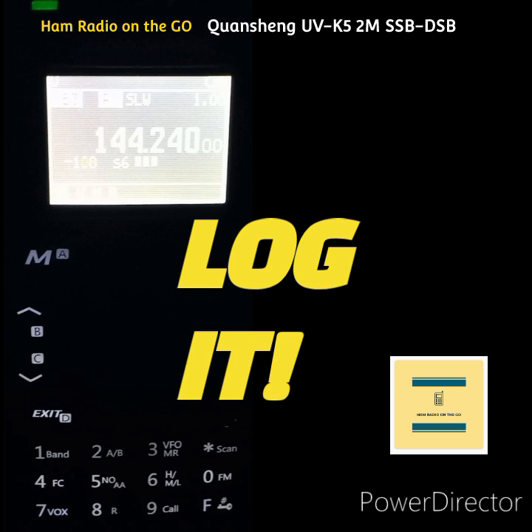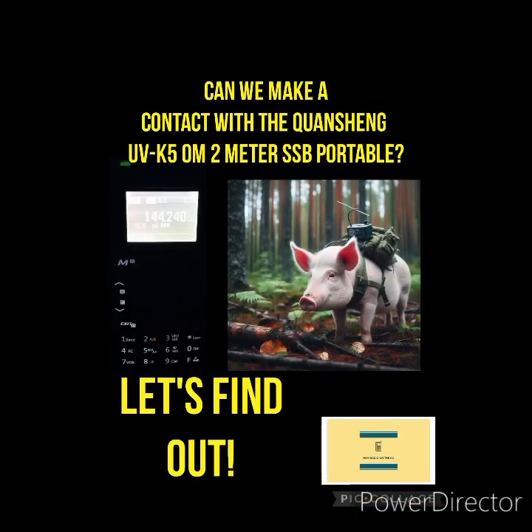There you go — a nice contact with Tony, WV2C, nighttime contact on 2 meter SSB. He was on upper sideband; I was using double sideband with the Quansheng UVK5. I've been looking to get a contact using that double sideband feature on the 3.0 IJV firmware upgrade to see how I can copy the stations and how they can copy me. Crystal clear audio reception of Tony's station, but he was hearing what appeared to be RF getting into the radio — that's the double sideband to upper sideband copy. Worth doing more experimentation with that mode, but it is promising that you can make contacts with double sideband.